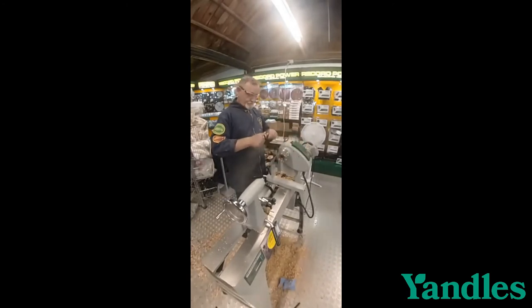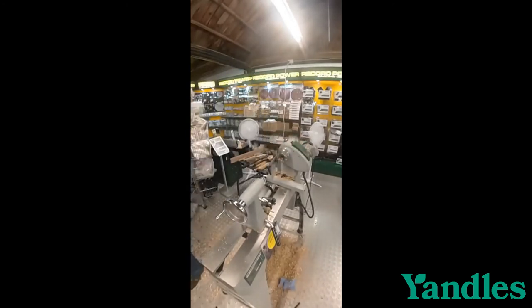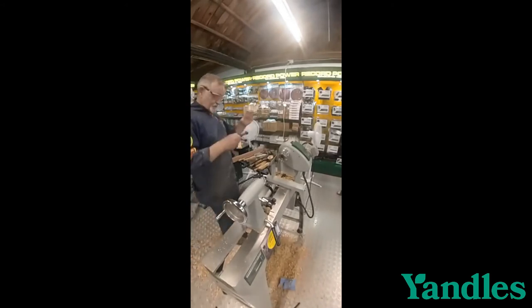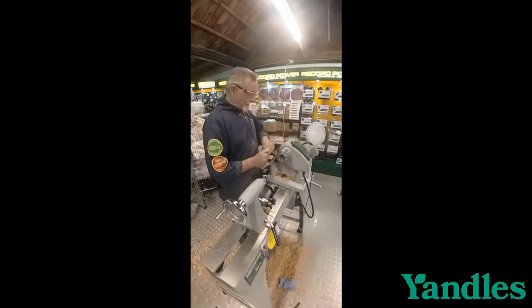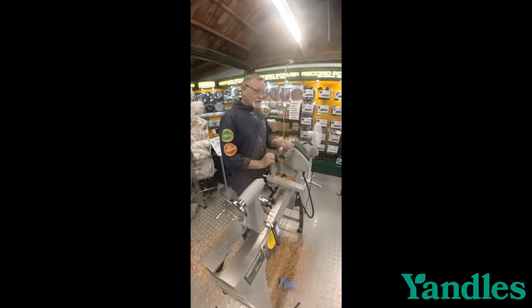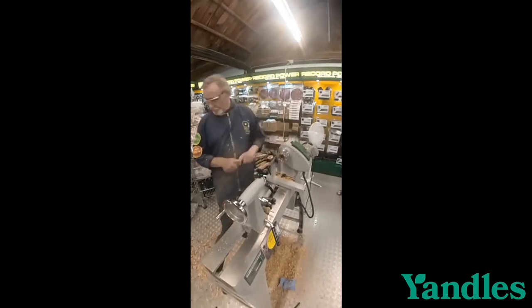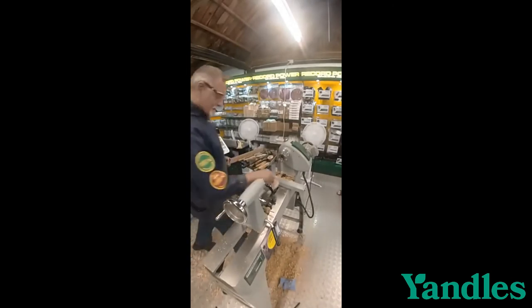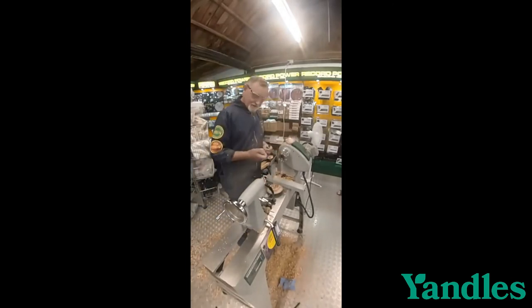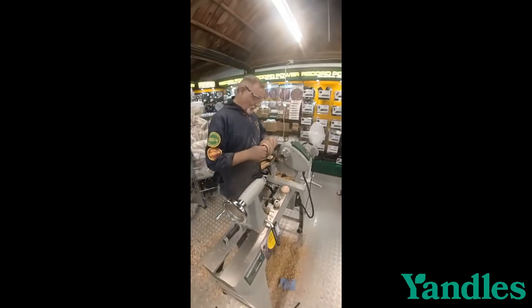So if I put a nut on, you need to cut the bolt end off, the hex end off. You can now lock them together and put that in your headstock or in your chuck. And you can start playing. And all of a sudden, that 3/4-16 thread lets you put on, let's put it actually onto, anything you want.